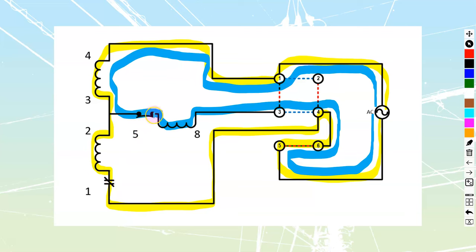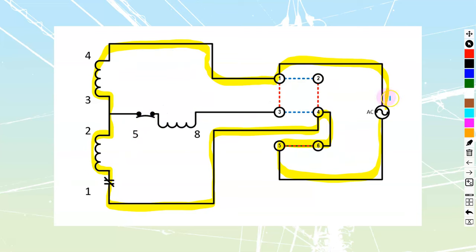We can still deal with that. If it's just a short little startup, it's probably not going to be a big deal because the overload is not an instant thing — it relies upon an overload happening for a while. So if this motor starts fine and kicks out, even though we started it bypassing the overload, all of my main run current still runs through it, which means we will have protection.